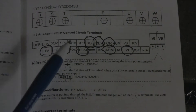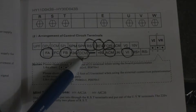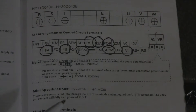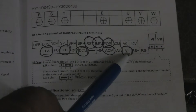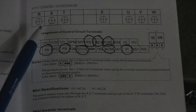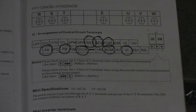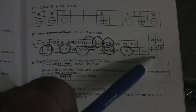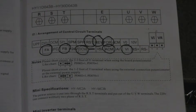FA and FB are the two terminals I use for fault checking on our system. DCM is the one that sends power out to the system and then eventually back into either RST, reverse, or forward. ACM hooks to spindle speed common, and VI hooks to spindle speed — those are the terminals you need to concern yourself with. The R, S, and T are the 220 volt inputs. U, V, and W are the 220 volt outputs. You also need to make sure the jumper is set correctly over by the terminal block for VI. The instructions show how to set that jumper for VI, which is voltage in.